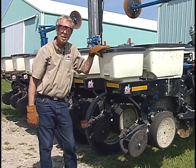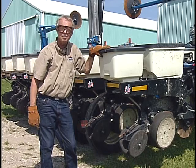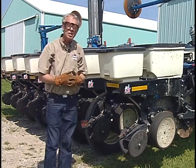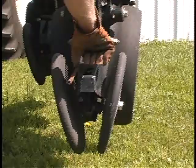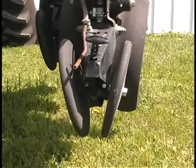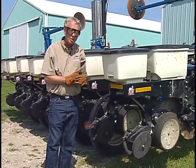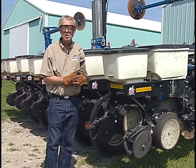There's a common mistake that people can get into, particularly in a no-till situation. They see that seed furrow is just not closing the way they want, so they'll readjust the down pressure and load it up, getting more down pressure on there. Particularly if that soil is wet or moist, you can really be adding a lot of compactive pressure to the soil that way.